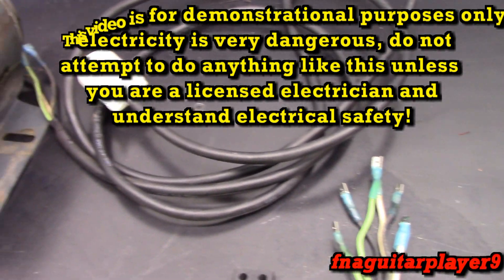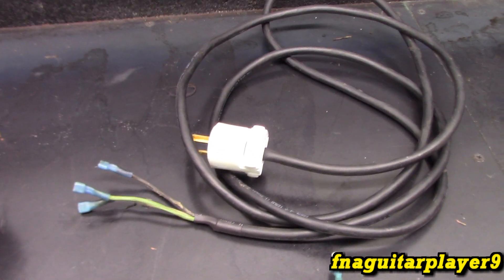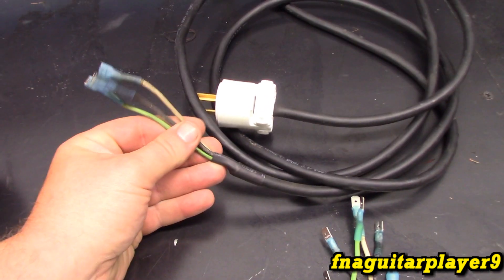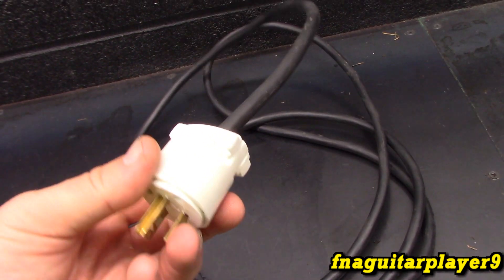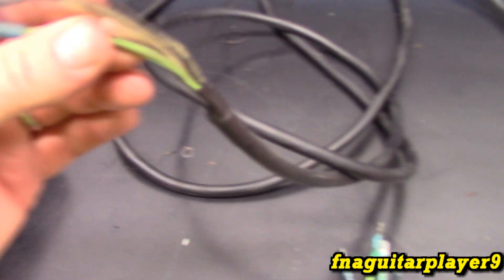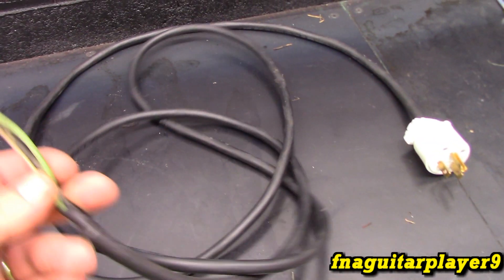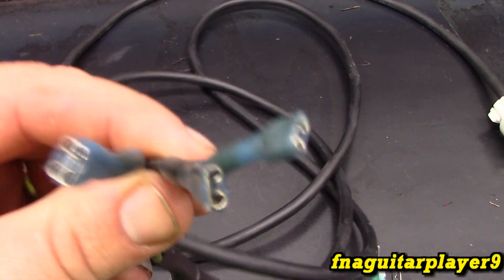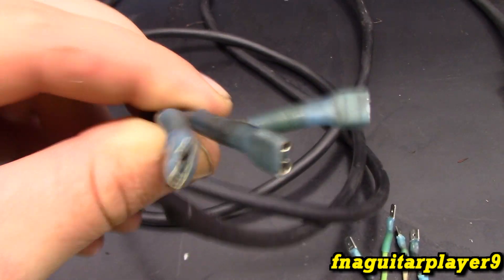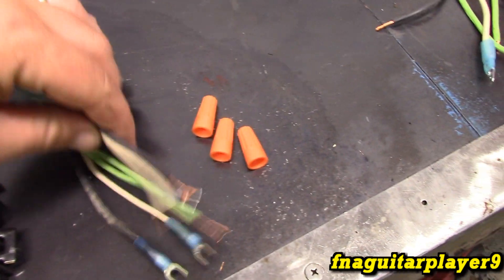It's always been a problem just finding a test cord for stuff. I've always used just some little cord like an extension cord — it's two wire, you know. So I decided to come up with this. I took a piece of 16-gauge wire, depending on what you're going to be testing with obviously. And this was actually a four-conductor wire. I did away with the red wire because there wasn't any point in it. So right here we got the female quarter-inch disconnect, which is a very common connector. And so I made up these sets of wires.